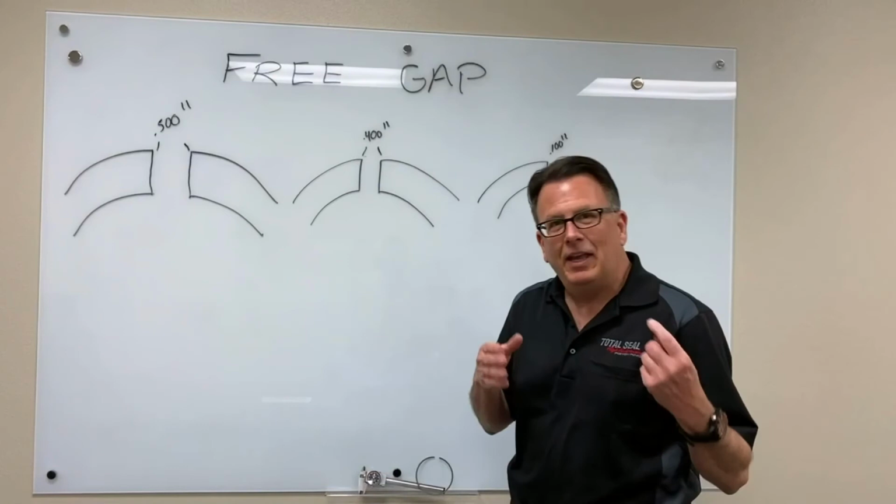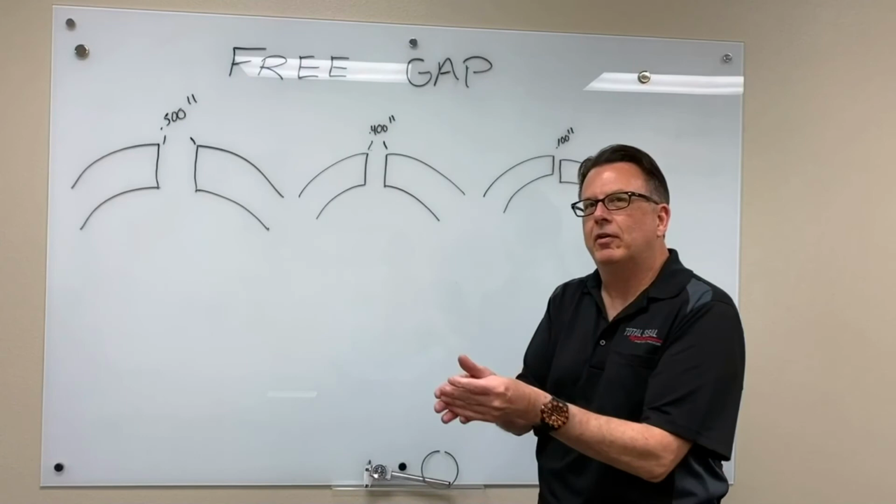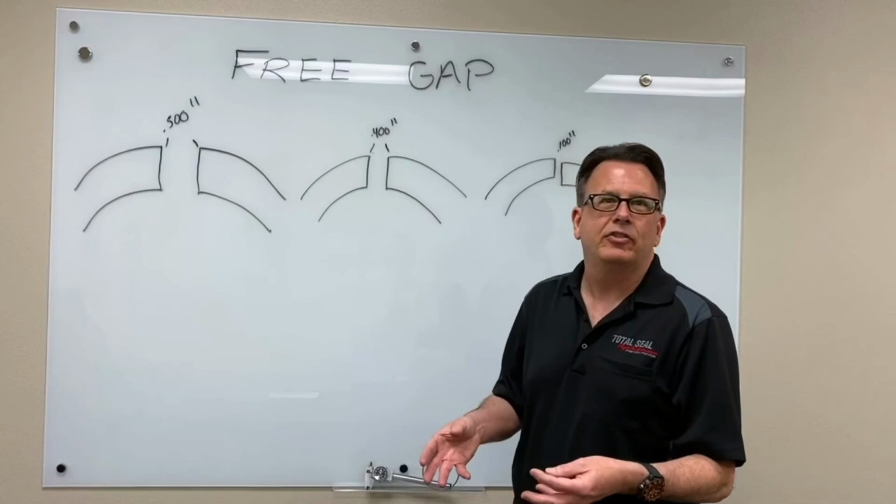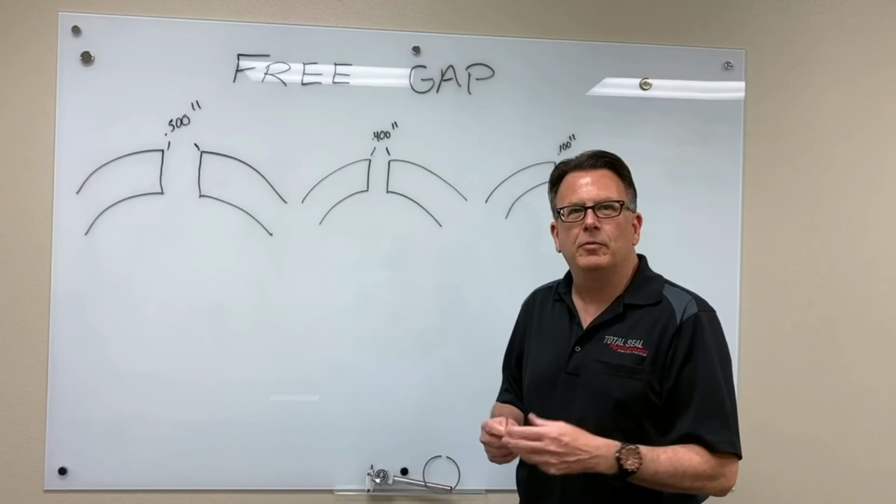But you ask, how do we get there to start with? Well, again, it's through those questions. We have to navigate all the different materials that rings are made out of. There's cast irons, there's ductile irons, there's hardened ductile irons, there's stainless steel, there's tool steel, there's even copper. All depends on the application. And that comes down to temperature and pressures. Different ring materials will handle different amounts of pressure.